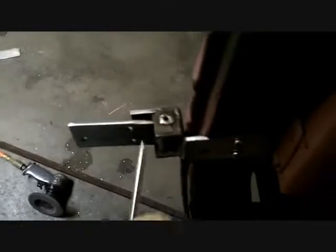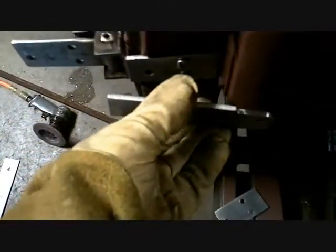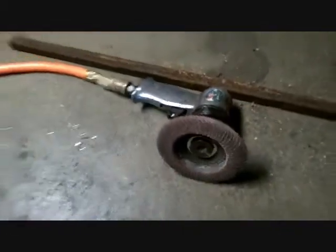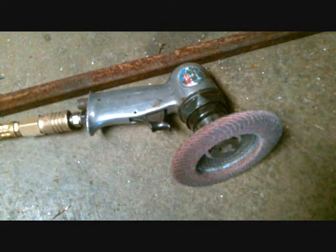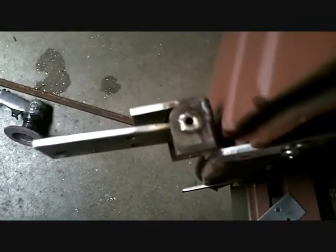So here's our doorpost mostly. This is a bottom plate, but if it was the top plate, it would be connected like that. That way when the door is shut, it would go like this. We got it — that one's gone, that's the replacement. There's one of them bolted on right there. There's going to be a lot of grinding to clean these up, and stainless steel doesn't just disappear like regular metal. An oxide flapper almost wants to disintegrate while you're grinding stainless, so we're going to have to use some hard stones. But there's my offset now — it's out an inch and over, I think it was an inch and an eighth.